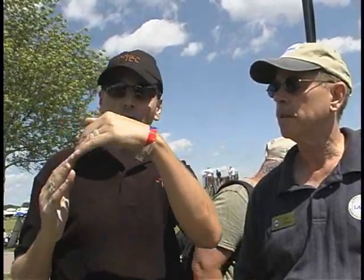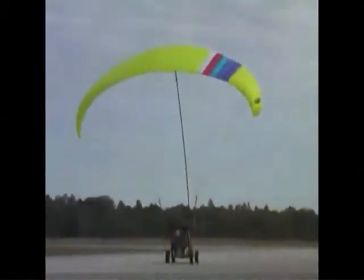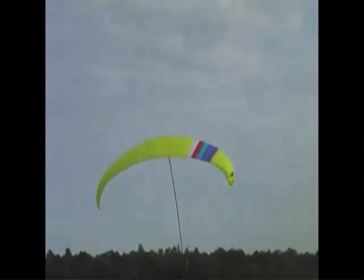You've got this great big thing, but the videos show it taxiing downwind and it appears like the wing just stays up there very nicely. Our mast system and wing deployment system gives a powered parachute some crosswind capabilities. We do not let the parachute get in the horizontal component of lift where it would ever want to roll you over. We make it stay in position so all it can do is weather vane. And when it gets a gust of wind, it just tries to fly — it doesn't try to pull you over.